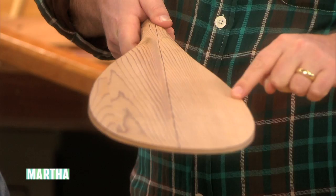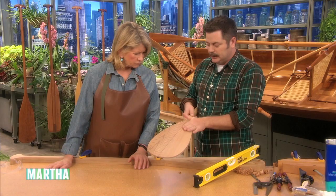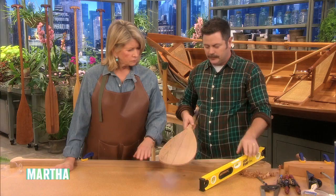Using your straight edge, you work from the peak all the way down to end up with the same flat plane. Eventually the block plane can't operate because it becomes a curved surface, and that's where the spokeshave comes in.